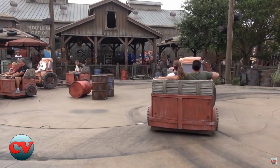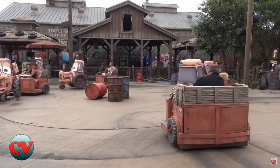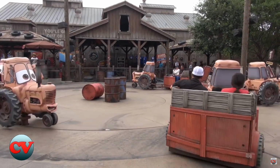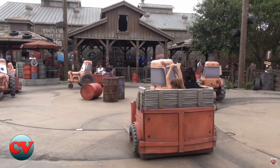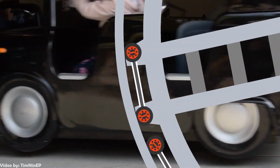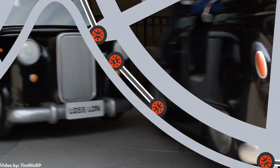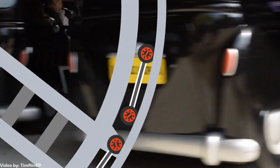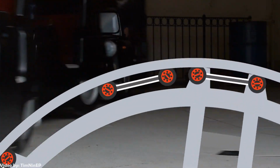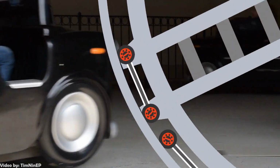vehicle will sit. When a vehicle is pushed over from one turntable to the next, the shuttle bars slot into the spoke arms where they are held. One of the six or five spoke arms will only grab one of the shuttle bars, not both. When the handoff happens, the arm grabs the shuttle bar that was not being held by the previous turntable spoke arm, since there's equipment in the way.